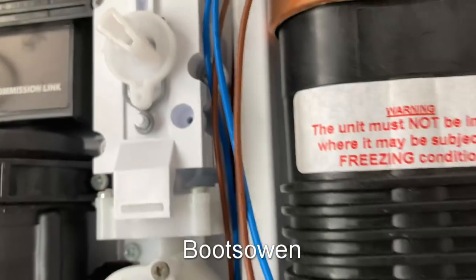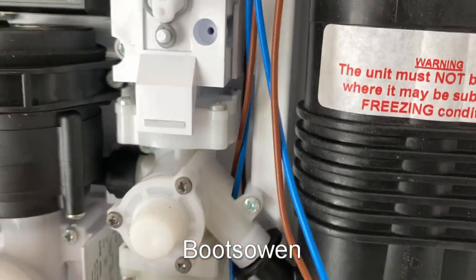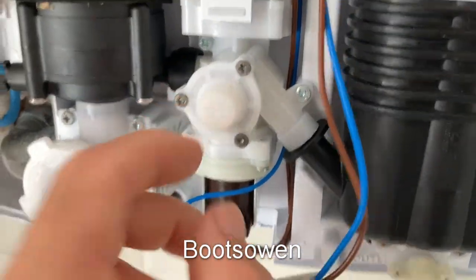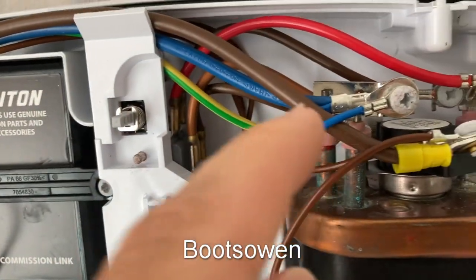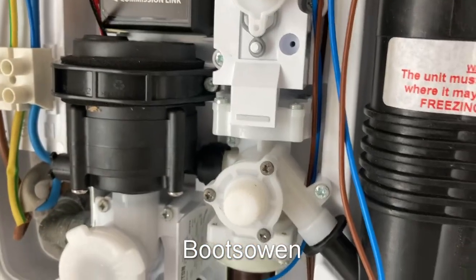Within here there's a little plastic pin going up, and that goes to a pressure switch in here. So these elements don't come on unless there's enough pressure from the water — so it automatically, if there isn't enough pressure, switches them off. So when you turn this on, the little cable is going up to here. That's blue coming to neutral and two lives — it's a piggyback. So when you press this on, it turns on this which also then feeds another line from here up to the motor. So the motor and the flow and the solenoid come on at the same time. Once there's enough pressure inside from the pump — because you need the pump to give the pressure — then it turns on a little diaphragm in here that pushes up a switch, which also then turns on these two elements, one or two or none, depending on what you've turned on. Because you can select none and have a cold water rinse.